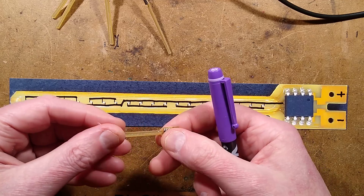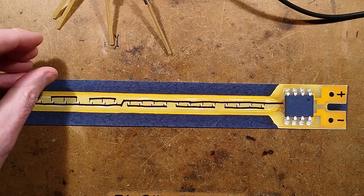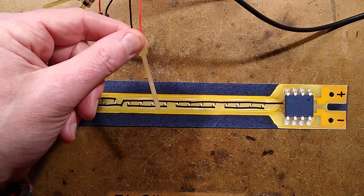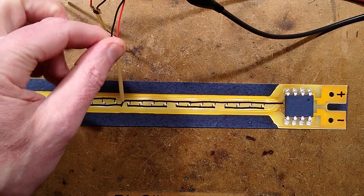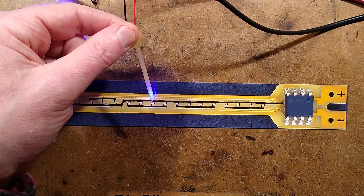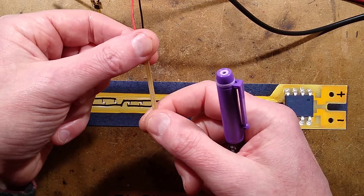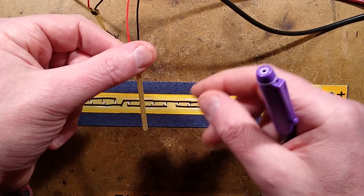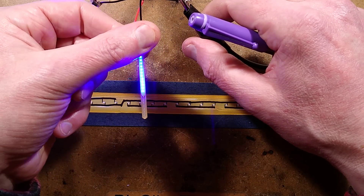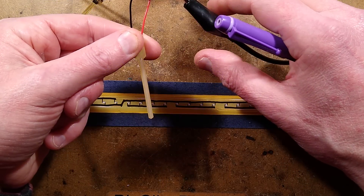The reason they put the gel on both sides is because some blue light will shine through the back of the circuit board. You can see it glowing through the back — that would also stimulate phosphor on the other side. It's going to be much brighter in front, dimmer in the back, but still visible as blue light diffused through the circuit board.